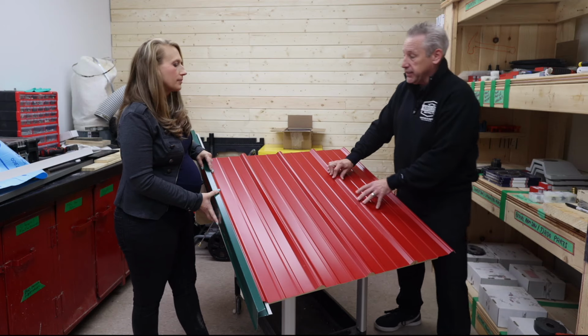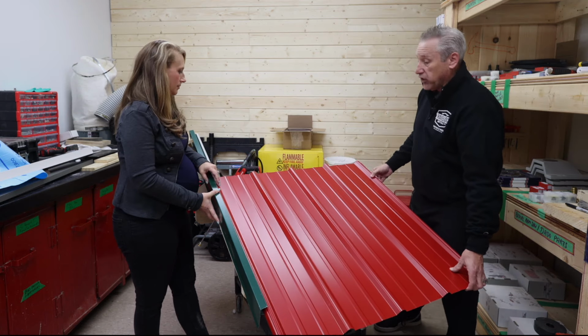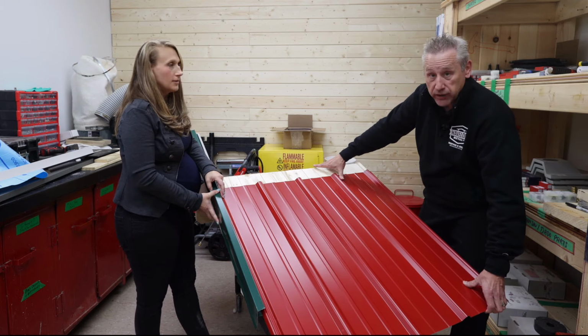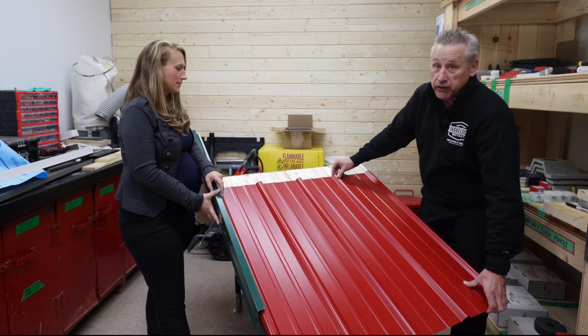Now, if I made it exactly the right length, and for some reason it's a little bit long, for any particular reason, you then have to cut the bottom all off or cut the top all off. So by having it be an inch or two less up here, you have lots of wiggle. Because remember, the cap comes down over top, right? Comes down 7, 8 inches on each side. You have lots of wiggle room to maneuver that panel down and up.